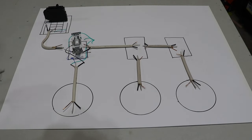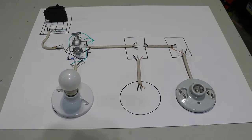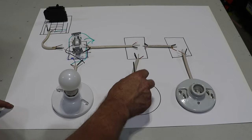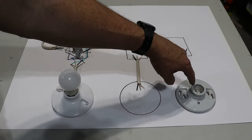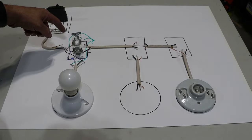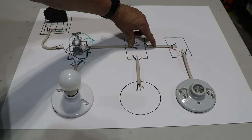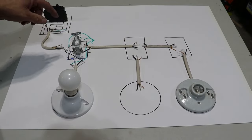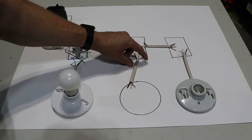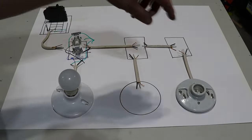What I'm doing today is putting in this light fixture in my office and putting in this light fixture in my air compressor room, but I'm not going to be hooking up this other light yet. In order to power this light, I don't need a switch here — all I need to do is connect these wires up. If you're finishing a project in different phases, you can hook these wires up, leave the other wire in the box — it's not hurting anything — get power over to this other light, and finish completing the work that you need done right now.